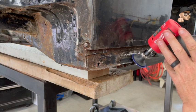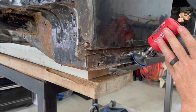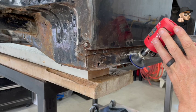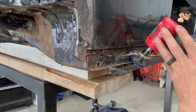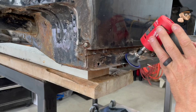One little thing I have learned doing this car is that I have to grind just the welds. If you grind anything else — other than a little bit of blending towards the end of the work — the metal is so thin it goes right through. So it takes a lot more time to just grind the heads off the welds to get them smooth, and I use a really fine little grinding wheel to blend the two areas together.